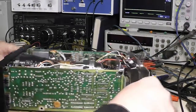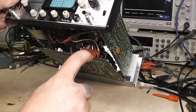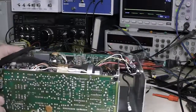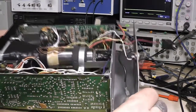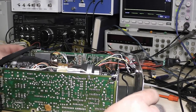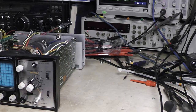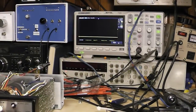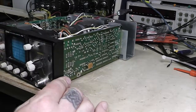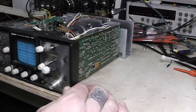Anyway, I'll keep working on it — I'm getting ready to put new capacitors in, I've got the board out. I'll get the capacitors changed out, clean up all the controls, then fire it up and see what happens. If all goes well, I'll run it for a few days. If I'm doing something over the bench where this 15 MHz scope is good enough, I'll just leave it running and use it for little checks and tests, let it run for a few days and see how it does.